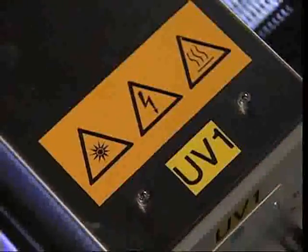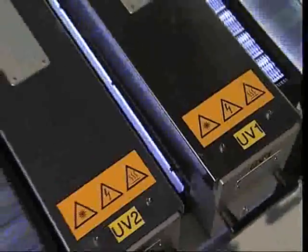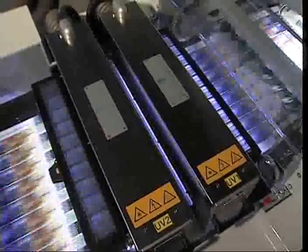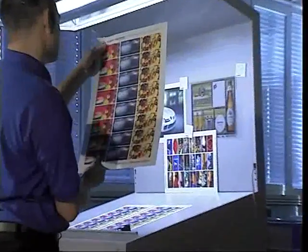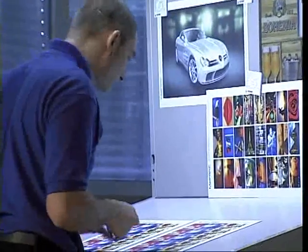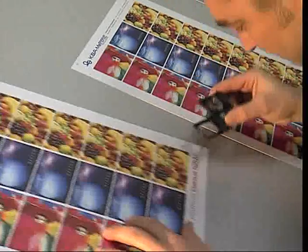The Genius 52 UV is most interesting in terms of economy for small and medium print runs, owing to short setup and refitting times. It gets to the inking stage faster than other machines, and this really pays off when jobs have to be changed frequently. The combination of the waterless offset printing method with self-regulating short inking units and exact tempering of the plate cylinder make the Genius 52 UV an attractive alternative for all users who, for operative reasons, prefer to work with computer-to-plate or analog plates.